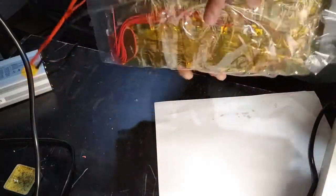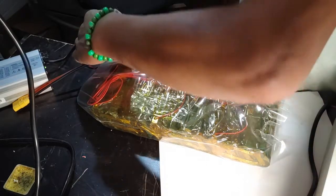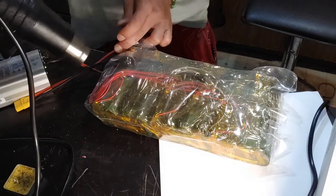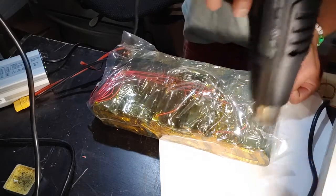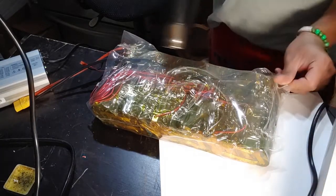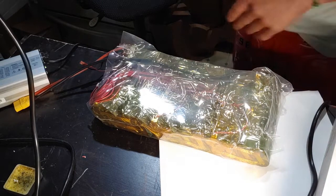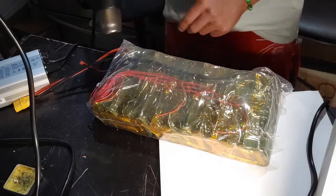and you're going to flip it over again, and you're going to do the same thing, sort of hold it here to make it a little bit smoother, and so you can have it shrink wrap over the sides here. Don't have it on too long, you might undo your soldering work there. And you can go ahead and work in all these creases. That's what the shrink wrap does. If you see a crease, work those in there, just like that.